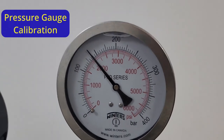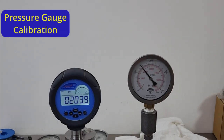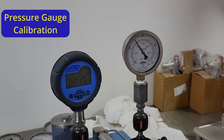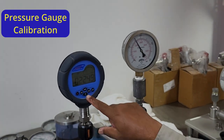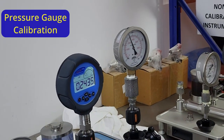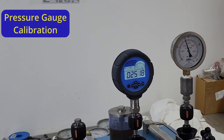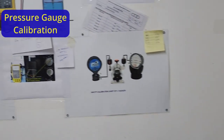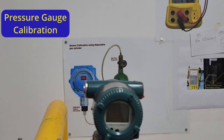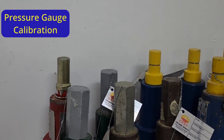Generally when you buy a new gauge, the tolerance of defect observed is very low, so very seldom do we need to adjust the pressure gauge. Now the technician is going to the next range, which is 75%, which is 4500 PSI. Let him raise slowly. In the meantime, let us have a look at the calibration shop — it is built on site, and you can see there are different types of standard calibration setups. This one is for pressure indication calibration.